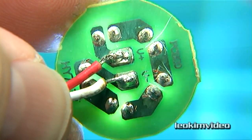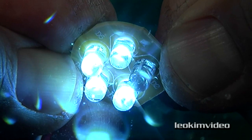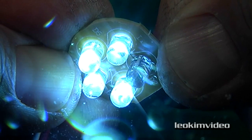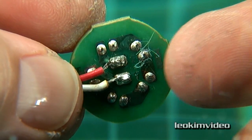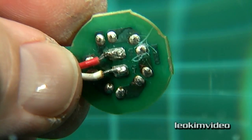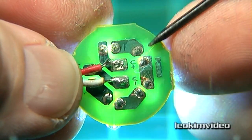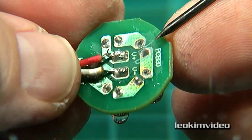Going on between these two posts here — and if I short it out, look what happens: the light comes on and stays on! And if I turn around you can see that one of those LEDs is non-functional — I'm just shorting out the legs behind it. So I'm wondering now whether one of those LEDs is defective. What's interesting is after I do a short circuit the flashing tends to become very irregular, like it doesn't like it. But if I come in with a bit of freon I can pull it down and it goes back to rapid flashing. So quite simply I'll desolder this LED off the circuit and I think I've got an LED here that I'll throw in just to see if I can get the array to be stable and stay on.